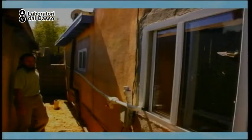Here we have a washing machine, three-way valve. Water goes to the landscape or the sewer. It comes out the window, over the wall, into the garden. They have a one-way check valve. The only reason they need this is because they send the water uphill after the valve, and you don't want water to come back into the machine after you do the wash. But if this pipe were to go downhill after the valve, you don't need this. They are in a climate with a very cold winter, so they drain the pipe before winter and just use the sewer in winter.